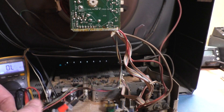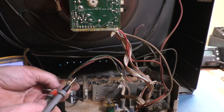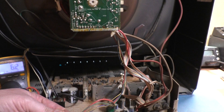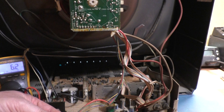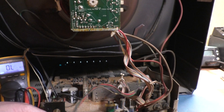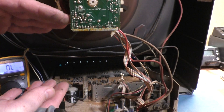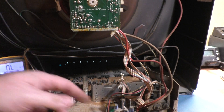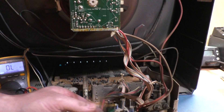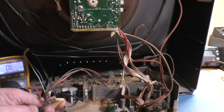Vertical is always the yellow and green, or yellow and brown, or green and brown — in this case it's yellow and green — and we have 6.2 ohms. That's kind of low; it may work. I think the lower the reading the taller the image goes, and the higher the reading the more you can decrease size. Where you run into problems is something like 15 ohms where you can't quite get it tall enough. So 6.2 may actually be fine — the vertical isn't as critical as the horizontal.